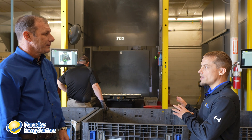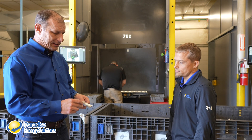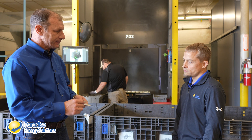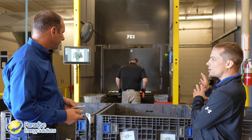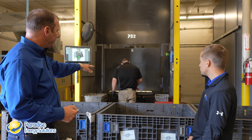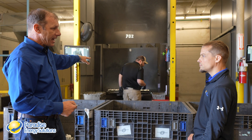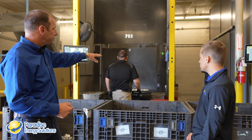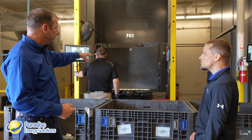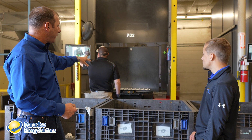We have a robotic welder here — it's taking two parts of the Protea assembly, aligning them in the fixture, and welding both sides to make a structural weld between the two pieces. The goal is to keep the welder running as quickly and as much as possible. While the operator is loading one side, the robotic welder is welding the parts together on the other side. When the operator is done, he uses two safety buttons to let the robot know he's ready, and as soon as it finishes welding, the table turns around and automatically starts welding the fresh parts.